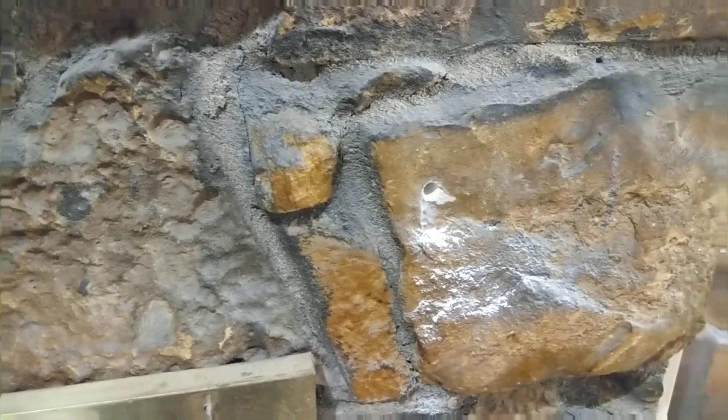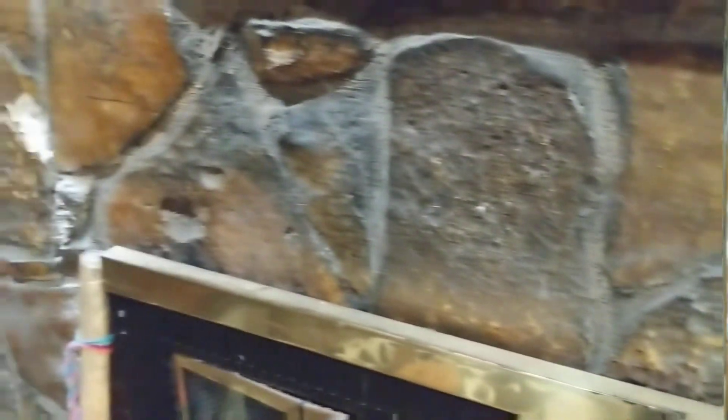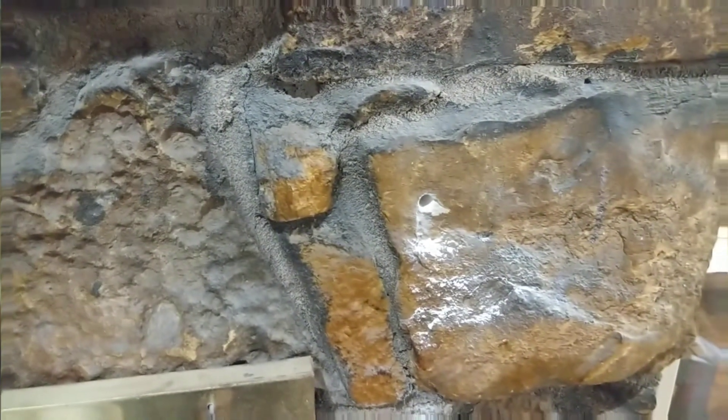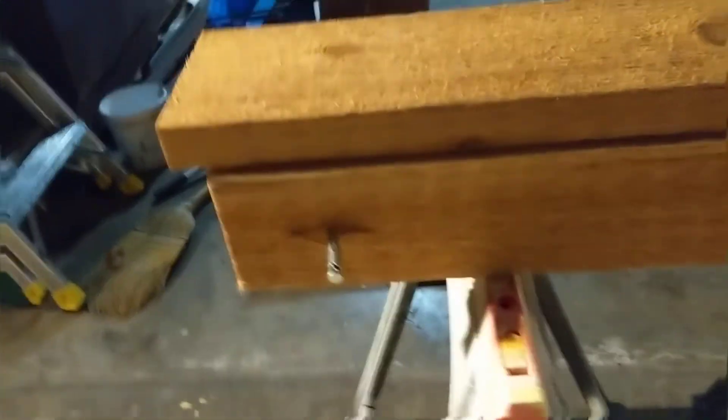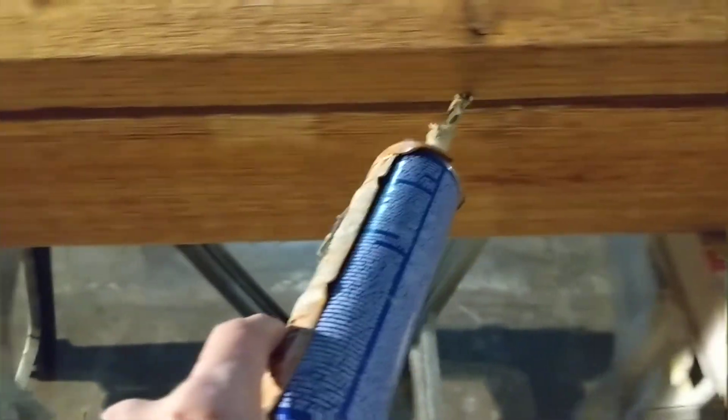I've got both of the holes drilled. Now I'm going to put it together and put it all on there at the same time — it'll be a lot easier than assembling it once I put that board on. There's the back side of it. I'm going to do about an inch overhang on both sides, approximately. And I'm going to glue this joint here and nail it with the nail gun, and that should ensure that it does not come apart.